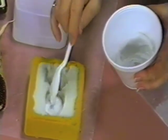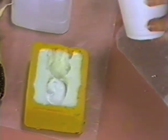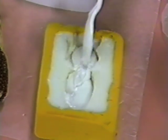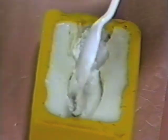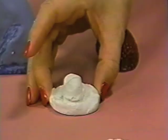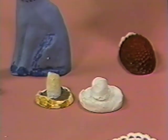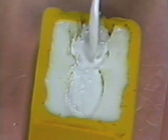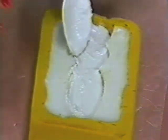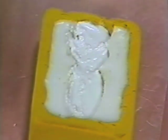Will it set up very quickly? You can remove it from the mold in about 30 minutes. You should really let it sit and cure properly before painting and final decoration — that should be done overnight, at least eight hours. Your finished product will look like this as it comes out of the mold, and it's ready for painting after it has hardened overnight. There is some thermal action — if you put your hand down there you would feel a slight bit of warmth — but it is safe and easy to use. We hope you'll try using both Instamold and Permastone to create objects you want to duplicate in any medium we've recommended.